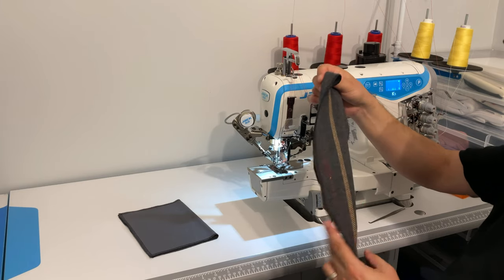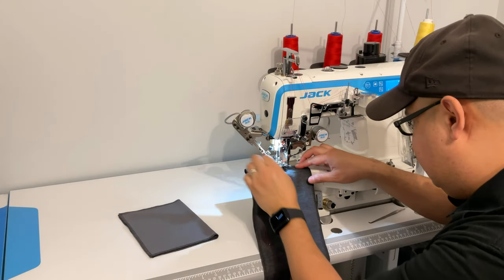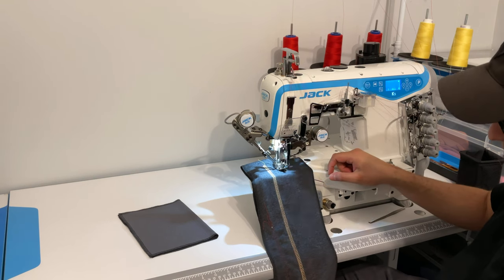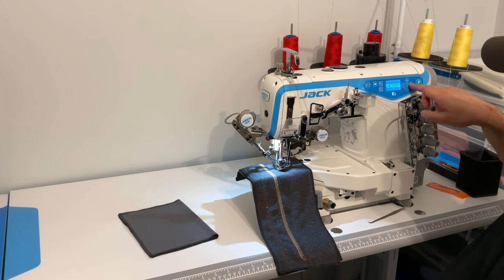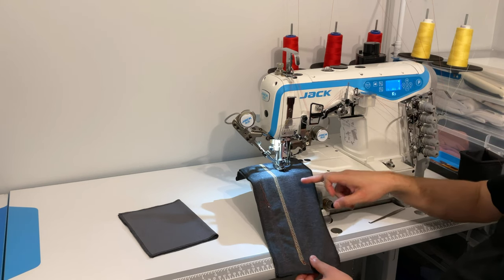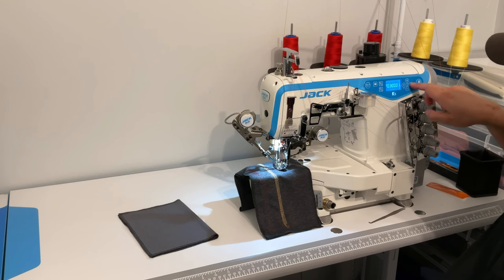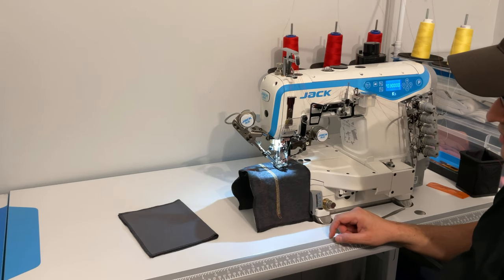There we go — a good one, and it looks like the wiper mostly worked on that one. You can see that every time I stop, the needles stop in the down position, no matter what. If I change parameter 03 and change the setting, now the needle should always stop up. See how it stops up every single time? Then changing parameter 03 back down — now it always stops down, and then I cut.